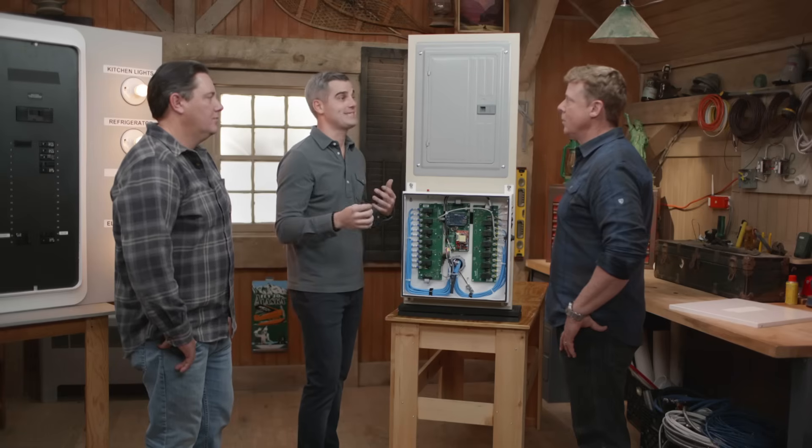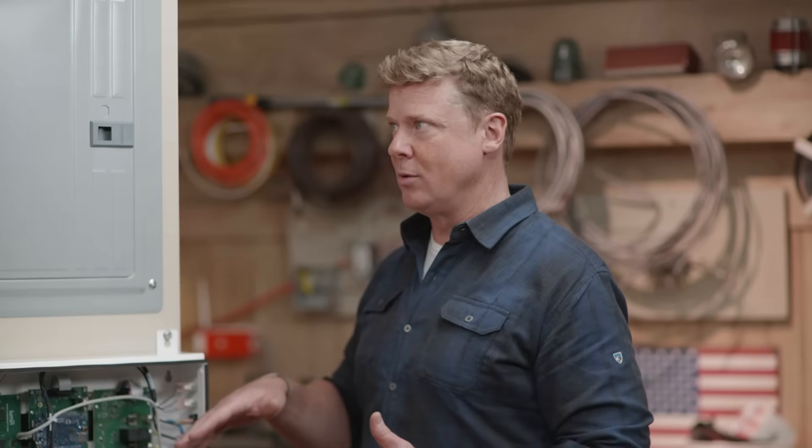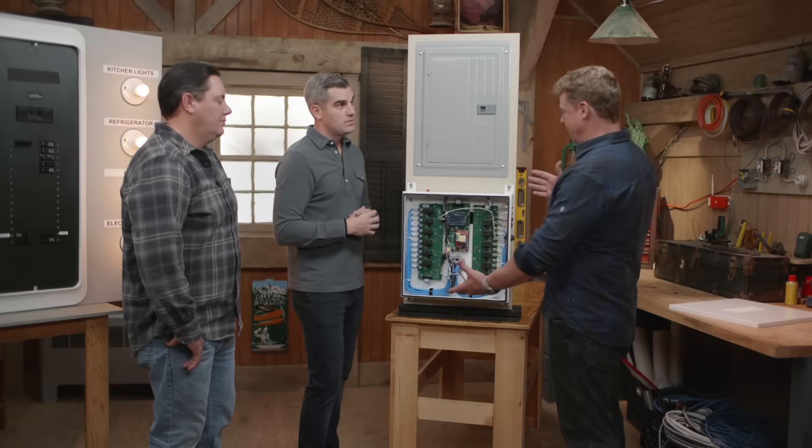And you can turn them on or off. That control part has been missing. We've always had the ability to sort of monitor, but now you're telling me that I can control. That's right. So why would I want to turn something on or off with this complexity? When we go to systems like backup power systems — generators, solar with battery solutions, what they call energy storage systems — in that case, you can't run all your loads at the exact same time. You might stall the generator or you might deplete the battery too fast.